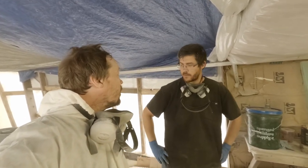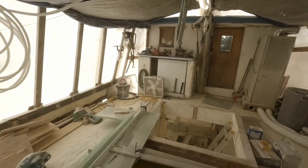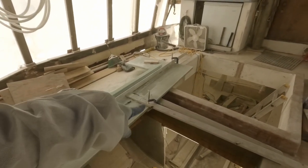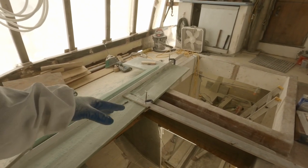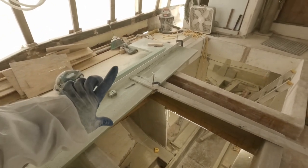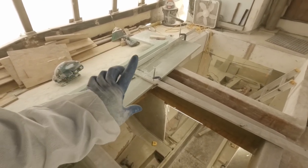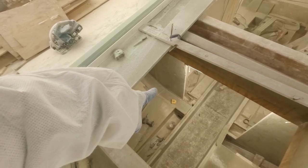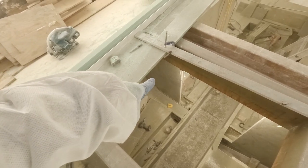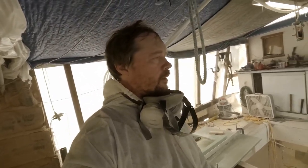It'll also cover up a couple of the seams from the assembly of the bulkhead. Yeah, that's true. Even though we've overlapped these two panels, there are upright seams. Like I say, the seams are staggered in relation to each other, but nonetheless, there's still seams. So these reinforcements will go basically where that tape measure is, up and down the bulkhead right there. And then the tabbing will go over that seam and just reinforce it more.